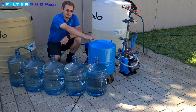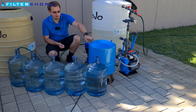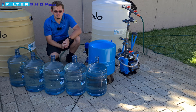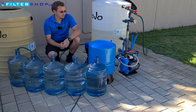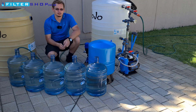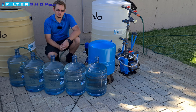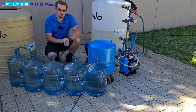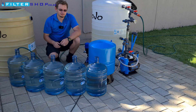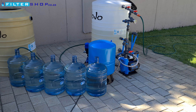The conclusion from today is that for the price of a buffer tank, it's almost a no-brainer with any pump. Depending on your use case, we saw between half and a third of the power consumption. Where it won't help is for irrigation, where you're running massive amounts of water continuously — a tank won't really make a difference there. But for domestic use with small amounts on and off, or short showers, we actually saw quite a significant difference.